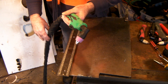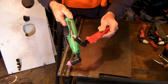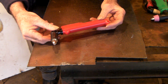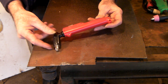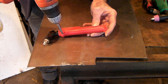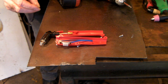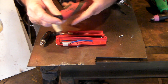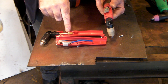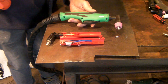Same old manky lead - save yourself some money guys. Now I'm going to pull it to bits again and put it on this SG61 torch head to see if we can get that to work. This SG61 is just a little bit different again - different but the same, just a different style of torch. These are up to about 55 amp I think. So we turn them over - what we have here is exactly the same as what we had in the first one, just got your switch in here. Same connector, same switch - hook your switch up, put your connector in, and start cutting.